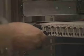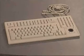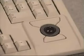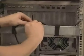To cable the switch box, attach 1 CPU to switch cable to each server connected to the switch box. Be certain to label the 9-foot cables for keyboards, monitors, and mouse before running them through the cable channel. Newer keyboards come with built-in trackballs, so mouse cabling is unnecessary for these models. Run the cables through the cable channel to the switch box.